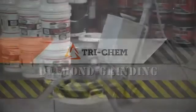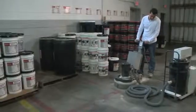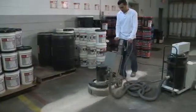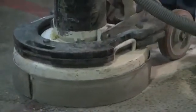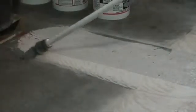Grinding is primarily used to remove coatings, thin polymer overlays, and deposits. In grinding, rotating abrasive stones or discs impact the surface at a high rate of speed. The stone or disc is applied under pressure and moves across the surface until the desired effect is achieved. The grinder is guided in a circular, overlapping path, producing little, if any, pattern. You can use a handheld right-angle grinder to remove epoxy coatings around walls, edges, and corners.